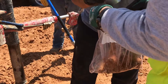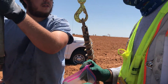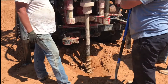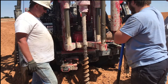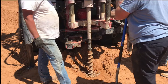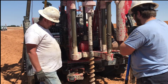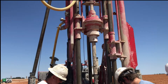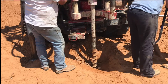As the video progresses and we get deeper, more tools are needed. This sample fell out easily into the bag — later we'll have to beat it out. You'll notice the driller is moving up and down in the hole; we call this a wiper trip. Basically, he's making sure the borehole wall is firm so it doesn't collapse as we pull out of the hole.